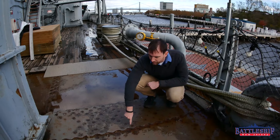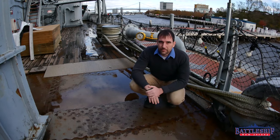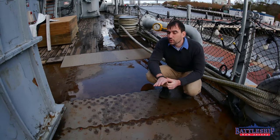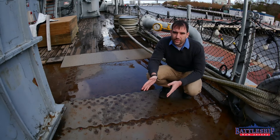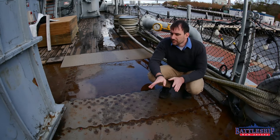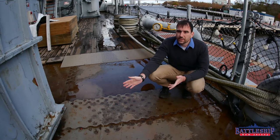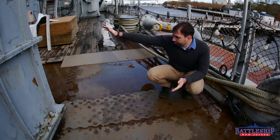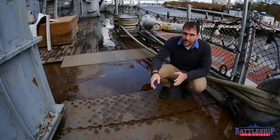This curve is so that it's giving just the right amount of metal for the rivet to grab onto. With other battleships — Yamato, King George V, Bismarck — they would just use a simple rectangular plate. But the U.S. Navy is trying to lighten the ship both to adhere to the Washington Naval Treaties and, if you can save weight on structural materials, then you've got more weight for adding aircraft, guns, radar, and everything else that has to be added in wartime. So by cutting all this away, you're saving a few ounces here, a few pounds there. There's one gusset plate about every 20 feet or so across the whole 109-foot width of the ship, so with a ton of these in use you're saving a fair amount of weight.